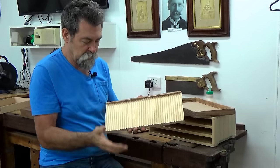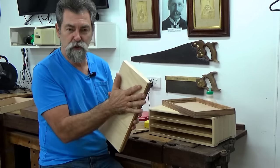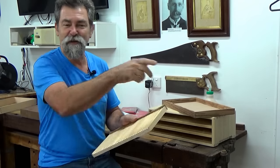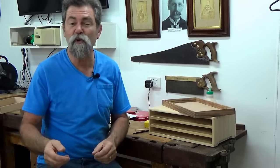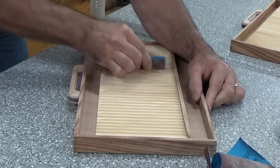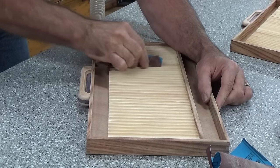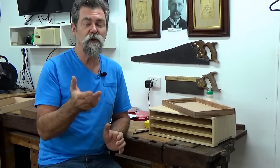Make sure you're just coating away and avoiding puddles — they look terrible. Do the edge but don't do the underside since it's already glued in. Also, I've got some video of using 320-grit sandpaper on the dowel to sand out these slots between coats — just a little bit, just to get rid of the raised fibers so that with the next coat it's super smooth. And you know what, it is super smooth.